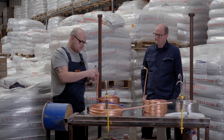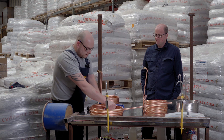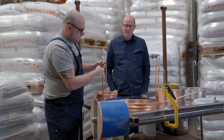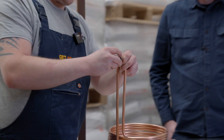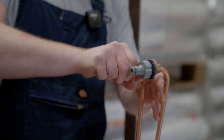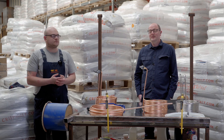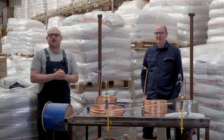Shoot them on tight enough to hold the water. We're going to use plumber's tape — wrap it on about five to seven times, hopefully it works first time around. Then we just use a normal hose fitting like for your garden water tap and they screw nicely onto the brass compression fitting — just tighten it up until it's hand tight. And that's the finished product! Thanks so much to Trevor for showing us how to do that. If you have any questions on the process, put them in the comments below and we'll ask Trevor to answer. Thanks for watching — until next time, happy brewing!